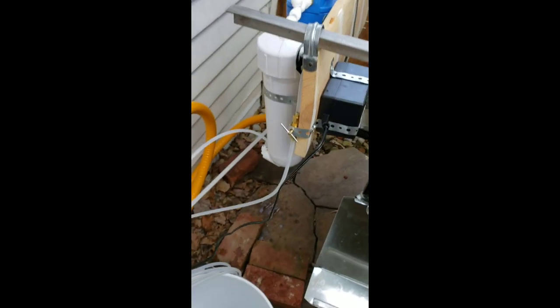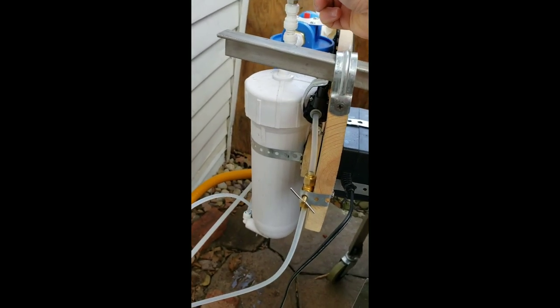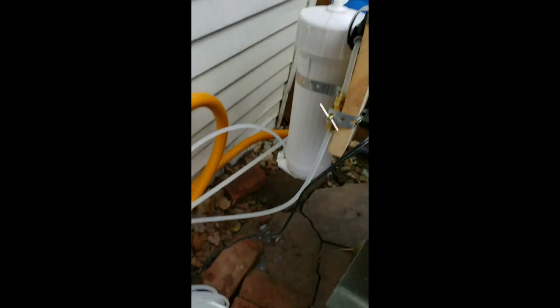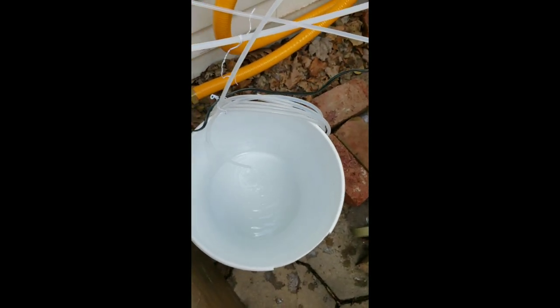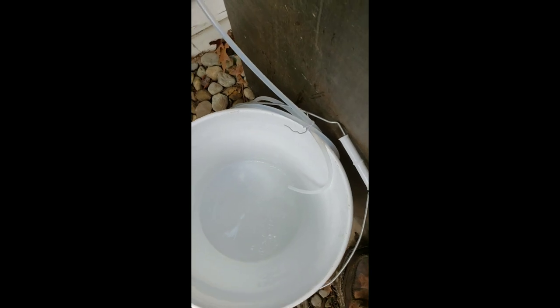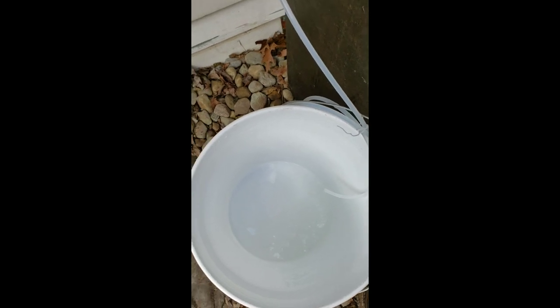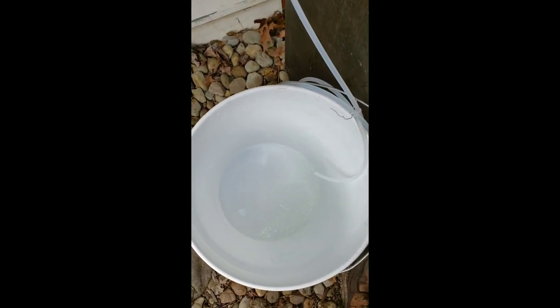Once those have a pretty balanced flow, we'll put this into the five-gallon bucket and make sure we get a good even split. We've adjusted the needle valve a bit more and our pressure is sitting at about 105 PSI. You can see the flow rate of the permeate coming out and the flow rate of the concentrated sap coming out are about even with each other — so these two pails should fill up at about the same speed. We'll take our concentrate pail, put it into our evaporator pan, and begin boiling for the day. Thanks everyone for stopping by Sugartree.